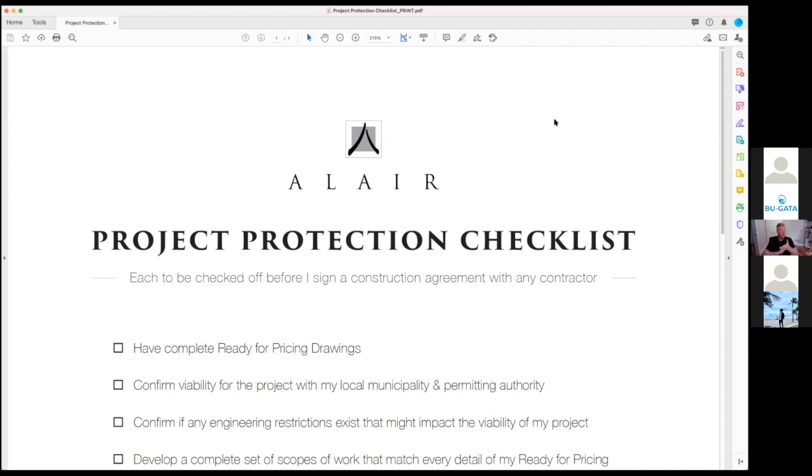And then there's the newer constructions that are after that, the 60s and 70s and 80s. That is the wild, wild west of our home construction in Arlington. We don't know where the quality is or what it is. There's some high quality homes built in that era. There's some low quality homes in that era. The codes and requirements, after having all these brick and block bunker style homes before that, were not there when they started going back to wood frame construction, and that's when they started using vinyl siding a lot, and sometimes a little bit of asbestos siding was left over. So there's large degrees of quality issues with those style homes.